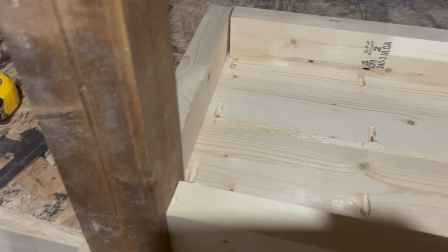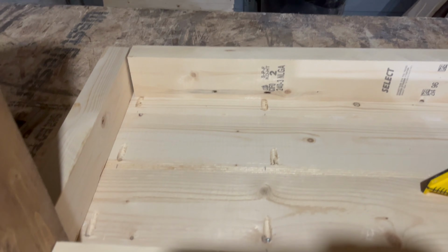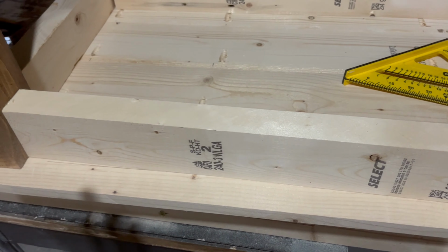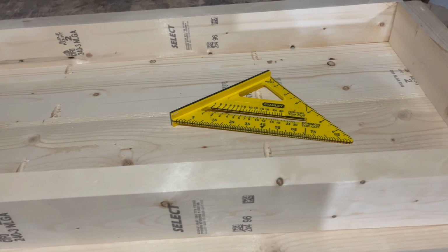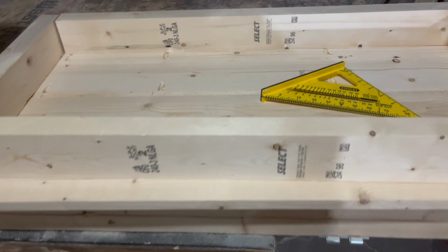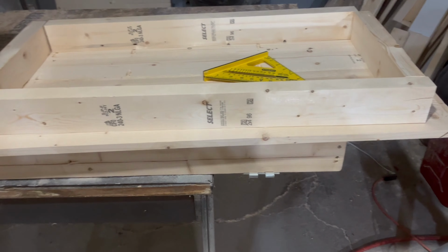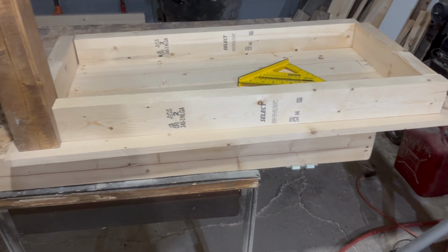So I just think I'm going to wait for those table legs to dry up, and then we'll come out tomorrow. We'll get everything placed on, cut in, or set in, cut down, and do some routing, and I think it should be looking pretty good. The final sand, get a coat of stain on, and then a coat of lacquer, and it'll look pretty good.